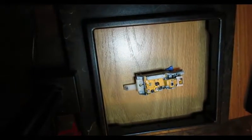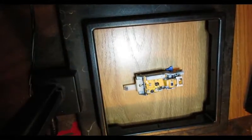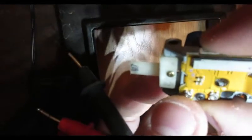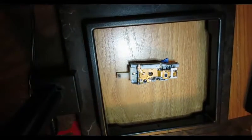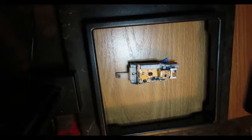You do want to make sure that you have a multimeter or an ohmmeter. On the top of the pot — those two dots, or two solder points — is what we're going to be measuring across. I'm going to sit down here and prop my laser up.